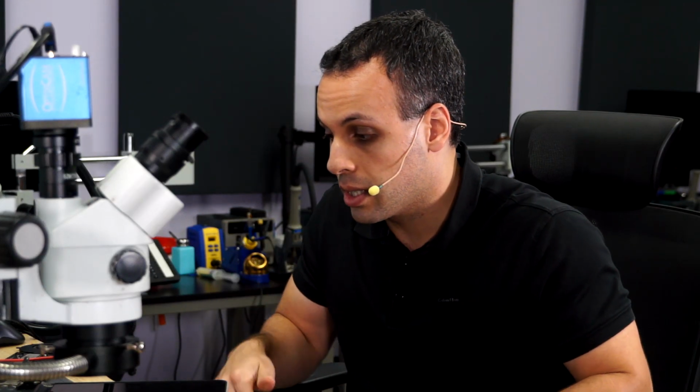And it's enough of a confusing issue that we've actually listed on repair.wiki as one of the very common causes of no backlight. This will not work. If you put a 2013 or 14 screen into a 15 or 16 machine, even though they have the same specifications as a screen in terms of resolution, color gamut, everything else, even though it uses the same connector, it will not work because Apple changed certain things in the pinout, so it's not going to function the way it did before. You'll get an image with no backlight.